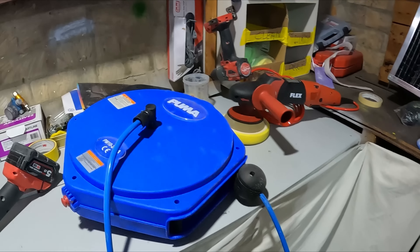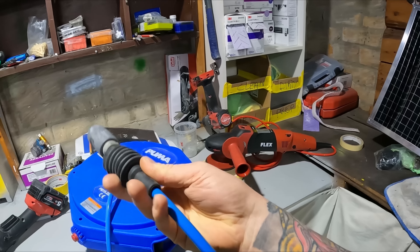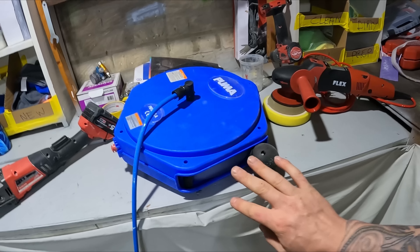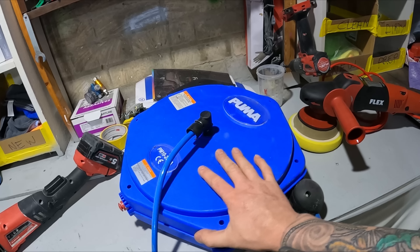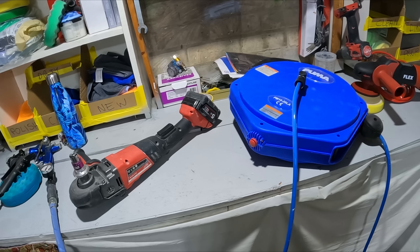The airline that came with it — the diameter is just tiny. I could barely even squeeze my air fittings on there. It's too thin, and what you'll find is it's not really ideal to deliver a nice amount of consistent pressure. I ended up just ditching it. It's quite long as well — the longer the airline, the further the air has to travel, and you're going to lose a fair bit of pressure, especially on this kind of home-use compressor. Use a shorter airline but a wider diameter where possible.